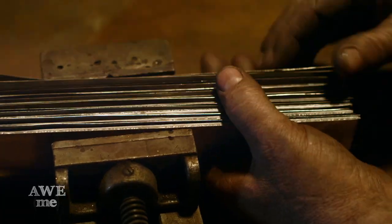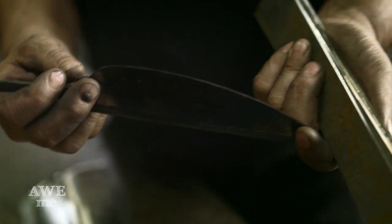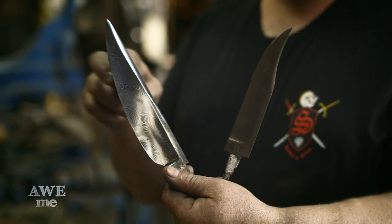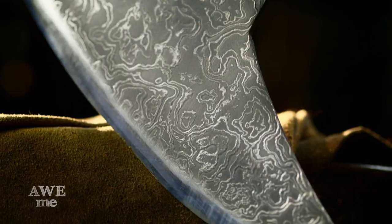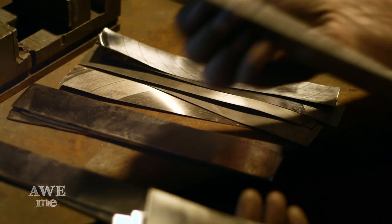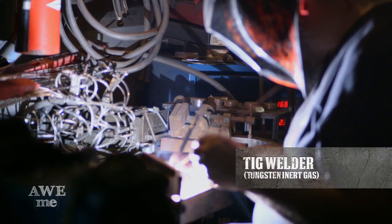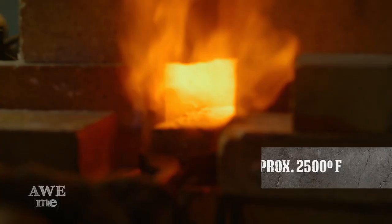Each different layer of metal has a different look to it, so it's going to look like wood grain, little swirls going through there, which is the main purpose for adding the nickel — it gives it a real bright color. I cut each piece of metal to 10 inches by an inch and a half, clamped them together on the welding bench, TIG welded the seams together so they were tight, put them in the forge, and fused it into a solid bar of steel.